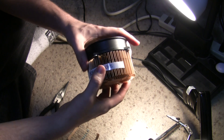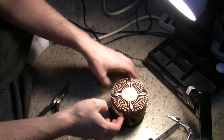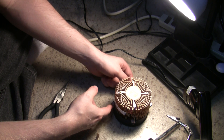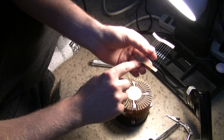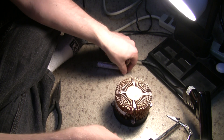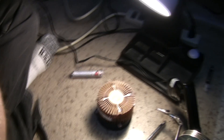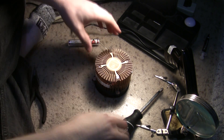To do this you have to take it apart, which I'm going to show you, but electronics are extremely delicate — it's hard enough to do this let alone try to film at the same time, so this might get edited quite a bit. What you're going to need is a 49.9k ohm resistor at 1% tolerance, solder, and a soldering iron. I don't have the most specialized tools here — I'm using Radio Shack type equipment, real basic.